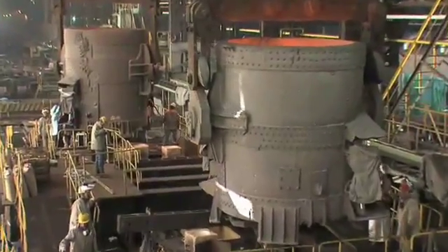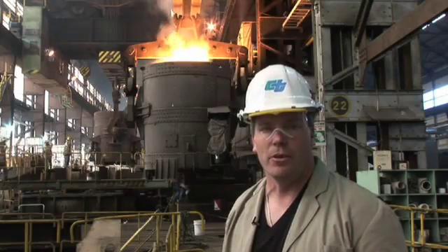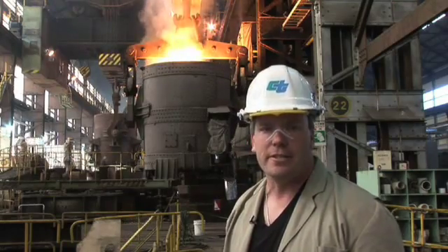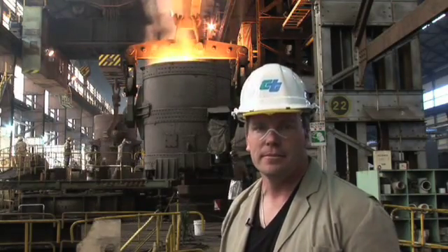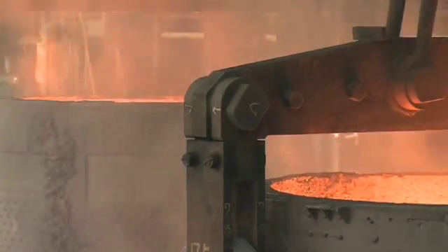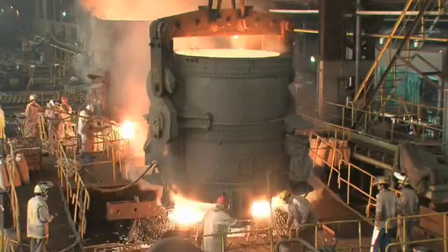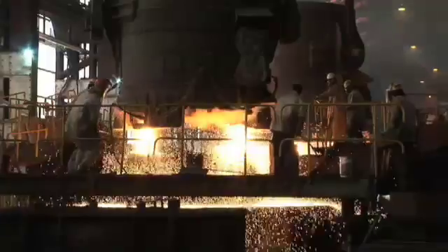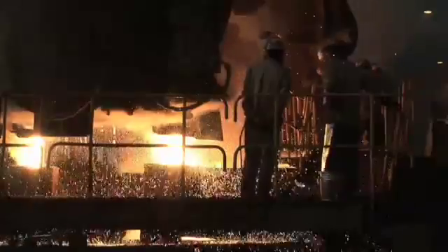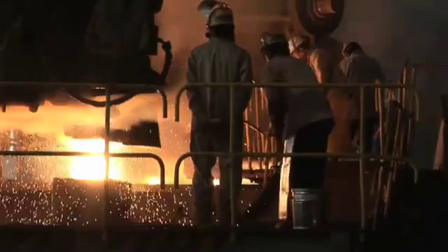We're in the foundry building, pouring the steel for the saddles on our suspension bridge. Over a hundred and sixty tons of molten metal will be poured today, at temperatures greater than 1600 degrees Celsius. Two ladles carry the molten steel — one holds up to 95 tons, the other 70 tons. During the most critical part of casting, steel is carefully poured into the mold, a process that takes several minutes, with workers in protective clothing standing inches away from the molten steel to ensure it fills every corner of the mold.